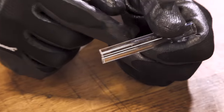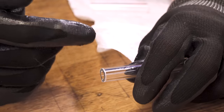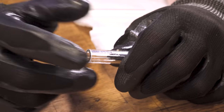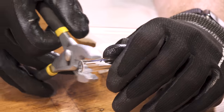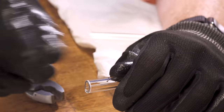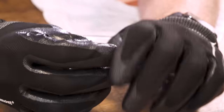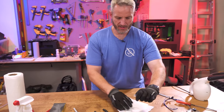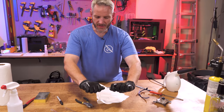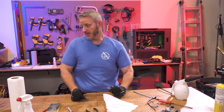Minimum distance of being able to crack the tube is something to talk about. So if you wanted to trim like an inch off, that's not going to happen — you're not gonna get the leverage you need on it. The mark we wanted to cut there — you're not gonna be able to score that because you can't get the grip. I've tried going, 'okay, what if I wrap it in a cloth and then take pliers?' No — the amount of strength that takes to clamp pliers onto it, it will just break pieces off and won't work. So I say if it's longer than being able to get at least two fingers on it — if it's shorter, you're not gonna be able to break it cleanly.